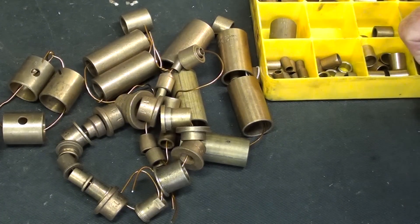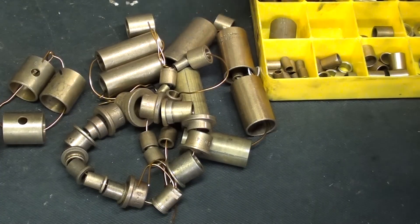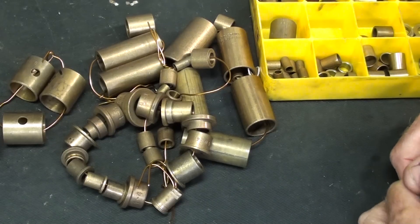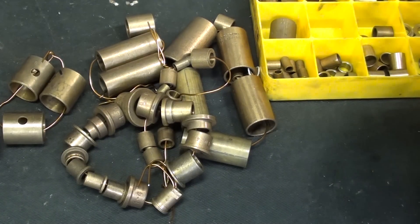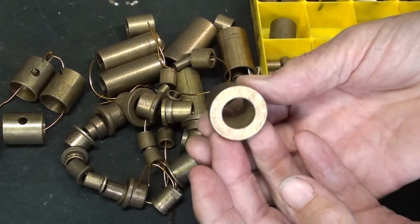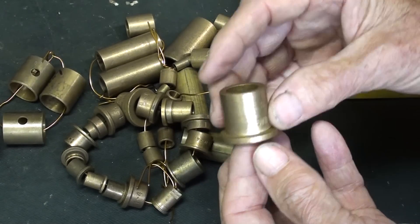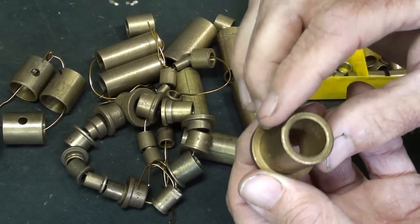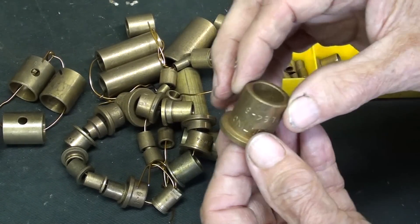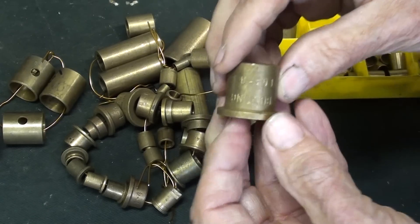So what is sintering? Sintering is a process of manufacturing parts — not always bearings — it's powdered metallurgy. In this case, they would be taking powdered or flaked bronze and pressing it into a mold of the appropriate shape with great pressure. They are then the correct size, no machining necessary, but they would be heated at a relatively high temperature to fuse them together. They're quite durable, however they are crushable — you could crush them in a vise or with pliers, so they don't hold up to that kind of abuse at all.